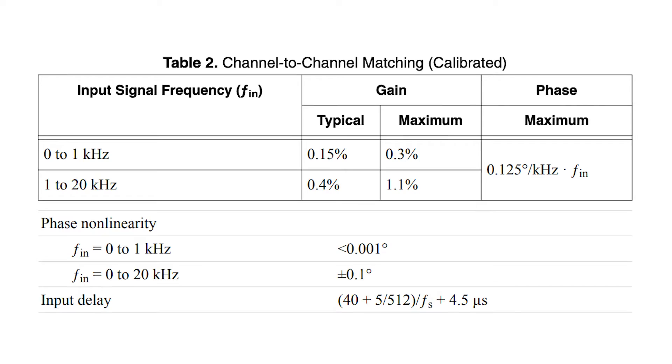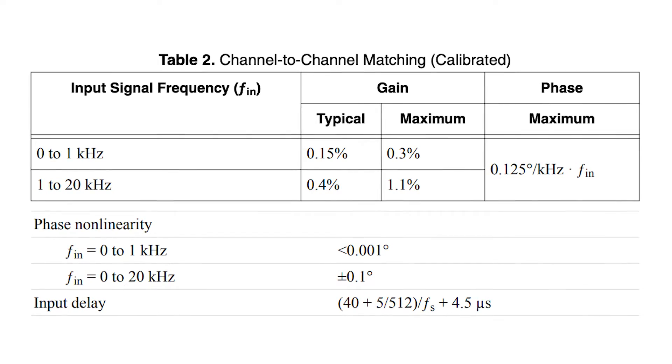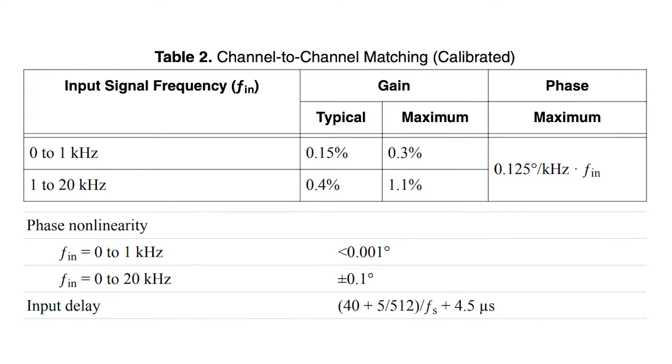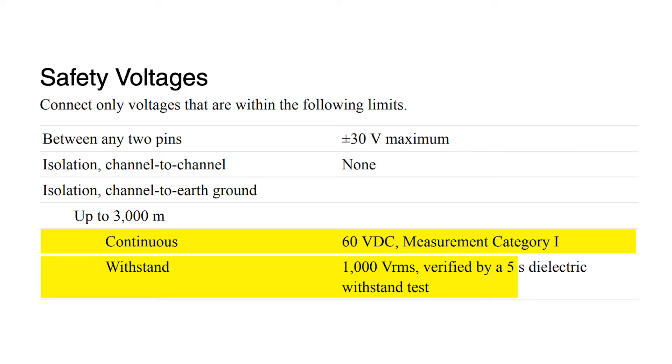The instrument has a value of zero for the interchannel phase delay. It implements a special mechanism for high common mode noise rejection and improves the safety capabilities of operator and test systems. This model comes with 60 VDC and 1000 V RMS transient isolation capabilities for this purpose.